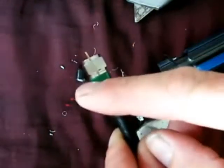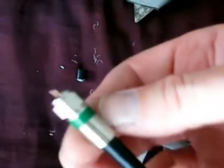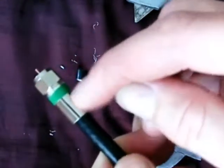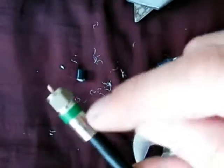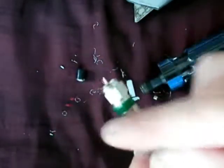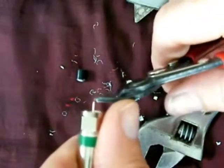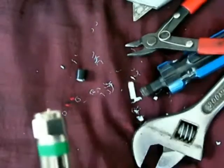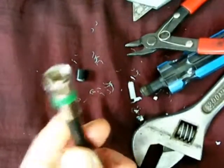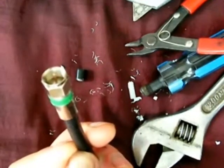No kinks — it's perfectly linear. With other glands you usually use a crimping tool that crimps that section, but with these particular connectors, which are the best, it doesn't kink the cable, so it actually helps your RF signals. Lastly, I think this copper core is a little bit too long, so I'll just cut it and leave about a millimeter. And that's it — hopefully that was interesting for you. That's it in a nutshell. Thanks for watching.